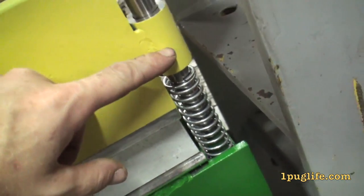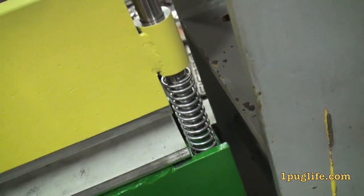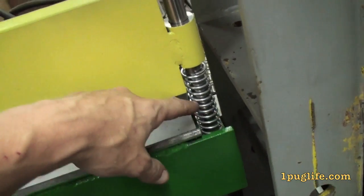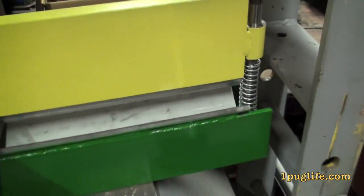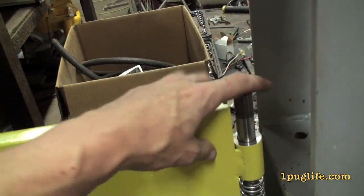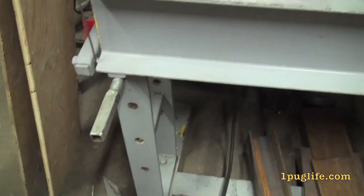If we go 5.5 inch spring, that crushes all the way down. These are too many coils, it's going to take up too much room. The corner's not going to get down there, so it needs to be fewer coils per inch, and a 5.5 inch long spring at least, maybe even 6 or 7 inches. We have lots of room in the stovepipe, right? We can go right to the top of this. That's not an issue, and I can drop that down.